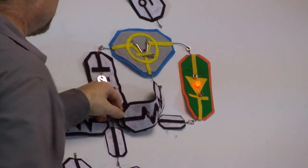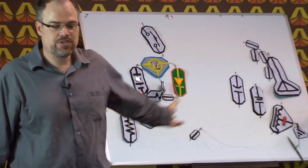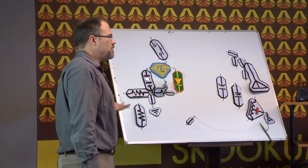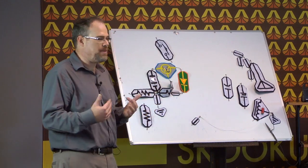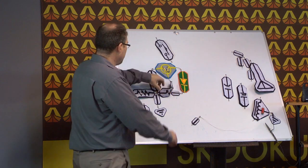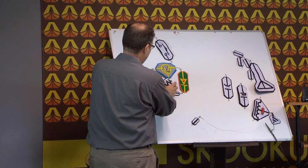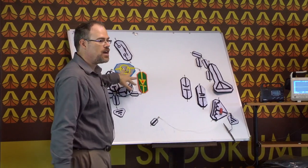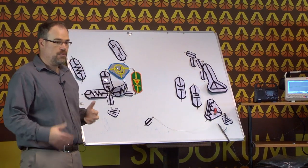So a little less traffic jam on the 1K. We're turning on transistors, and we're turning them off. Now, I only have one transistor up here, which means not a lot of logic happens. But your computers, of course, is when one transistor turns on another transistor. And there's a really important component here, which is feedback. So when I turn on a light, this light, in theory, right, I could point this light directly at the light detector. And then this circuit would, when it turns on, make itself turn on. And that's sort of how computers start making more complicated circuits.